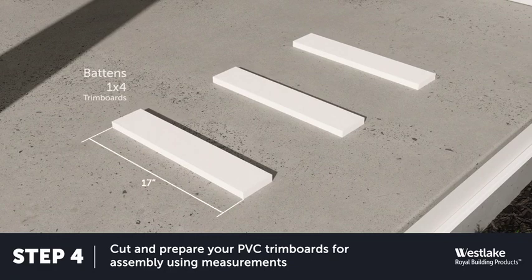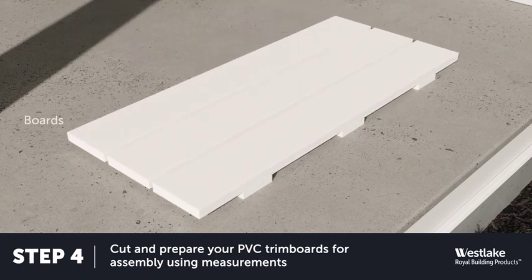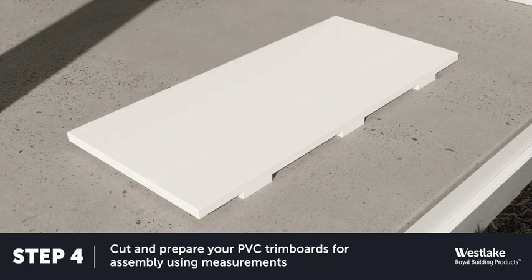Place the 3 1x4 trim board battens face down on a work surface, and then lay the 3 1x6 trim boards face down on top of those trim boards. Create half-inch spacers and position those between each 1x6 board.